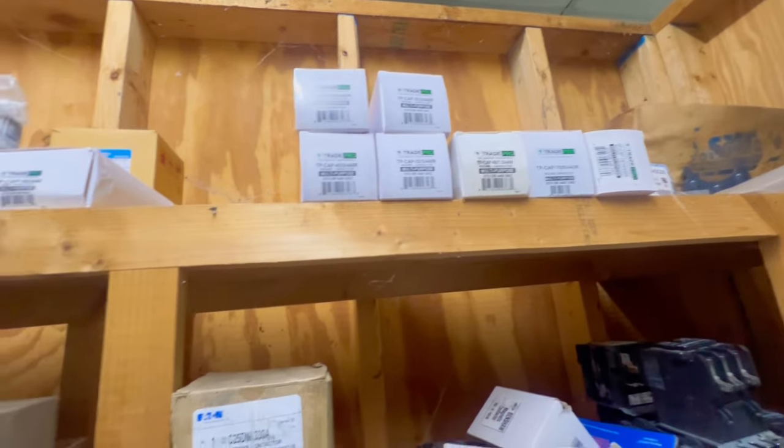We're also in a tornado watch — my area had a flood warning too, so it's rough out here. Alright, I'm back. Got the capacitor just that fast. I'm going to go with a 45/8 instead of the 35 plus 7.5, but it's about the same so this one should do fine. Just swap it out, make sure the compressor and fan kick on, and go from there.